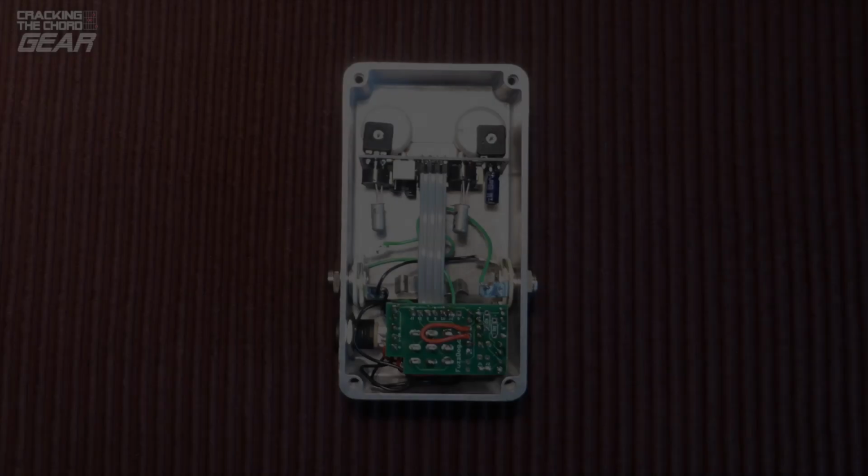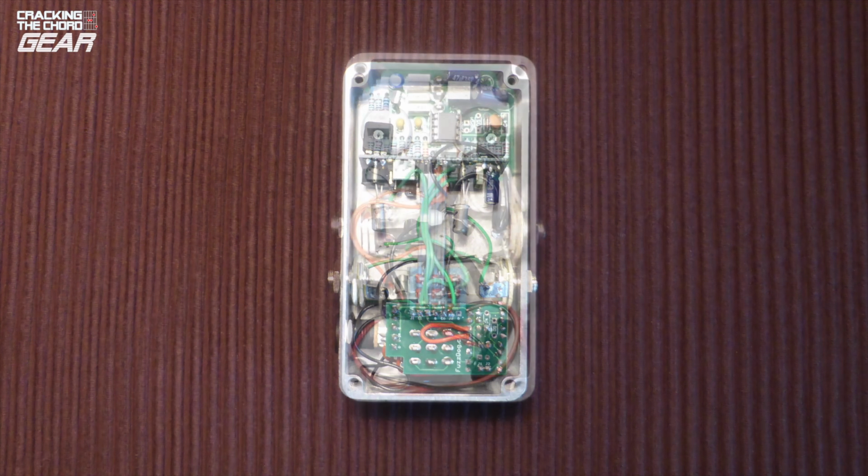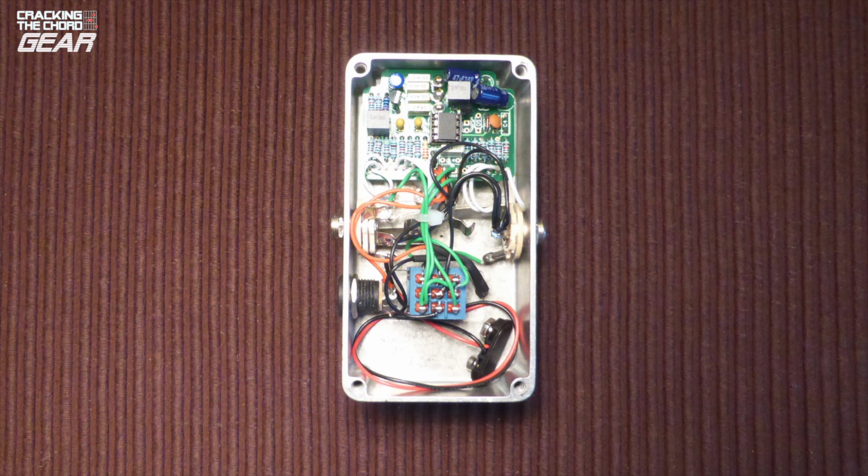As a condition of providing troubleshooting support, most kit providers will insist that you test the main board to ensure it works before assembling the pedal. That way you and they can confine fault finding to the main board. For a more tidy build, the 4-way ribbon connector and daughter board works well. Look at this pedal with wiring straight to the switch compared with a ribbon connector.